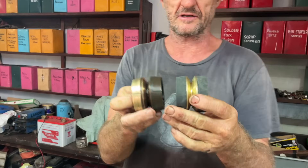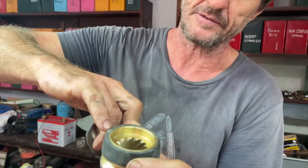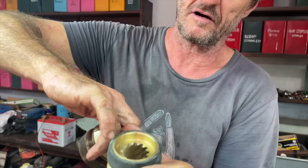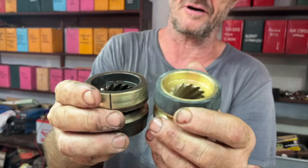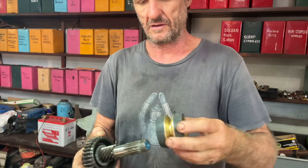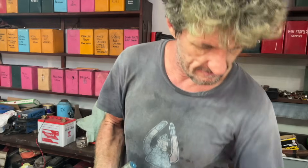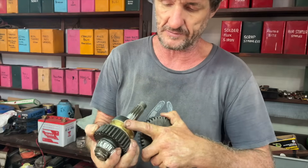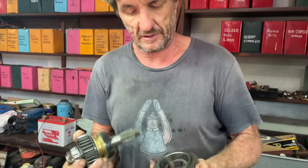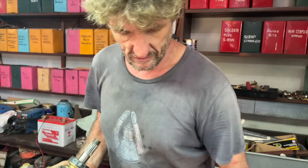As you can see, one side is completely worn - there's a sort of coating, a black coating, like a brake disc. It's a fibrous coating stuck over the top of the bronze metal clutch cone itself. Mine on one side is completely worn off - no more coating at all - and the other side also doesn't have much left. You can see the brand new one next to it - huge difference, probably 5mm of coating on there. No forwards or backwards on these clutch cones - either way goes on - just slide it onto the shaft, whichever way, freestyle it.